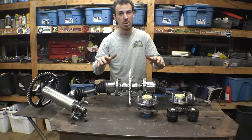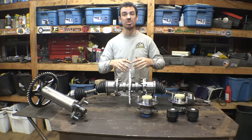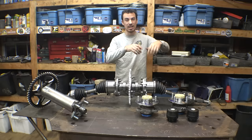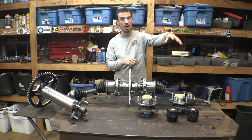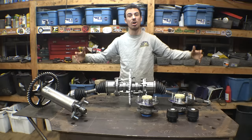Alright, so the front wheel drive setup is finished for this thing. Now, how this is all gonna work is basically, I'm building it almost identical to how the CBR 1000 project is set up, where it's chain driven trailing arm suspension, the engine's in the back, and it has a chain going from the engine up to the T90 transmission. I need to find another T90 transmission for this project, and then that goes to a 1¼-inch jack shaft that also works as a pivoting point for the trailing arms.